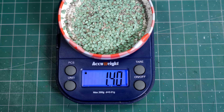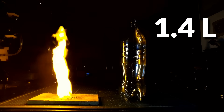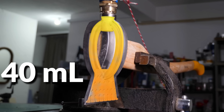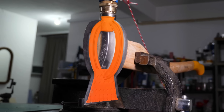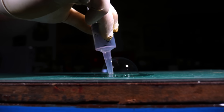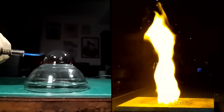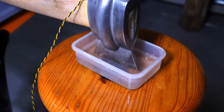I think I messed up big time. I did some calculations and a shotgun shell has precisely 1.4 grams of propellant, which when it burns decomposes into 1.4 liters of hot gas — it occupies more or less the space inside of a soda bottle. My axe has internal channels with 40 milliliters of space through which these gases travel. Because these channels have much less space than a soda bottle, the gases get compressed, which increases the pressure and makes the log go boom. On the other hand, the 40 milliliters of oxyhydrogen I can inject into the axe burn to produce a measly 300 milliliters of gas — about 5 times less gas and pressure. I was fooled by the loud bang the oxyhydrogen puts out. Sure, it burns fast, but has little to no power. My beautifully perfect solution doesn't work.